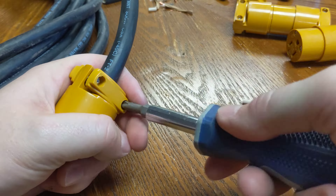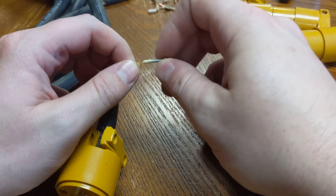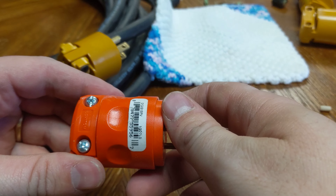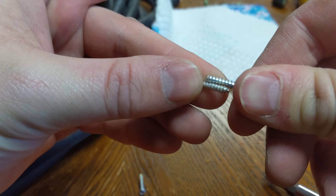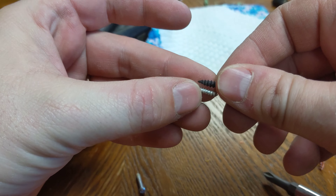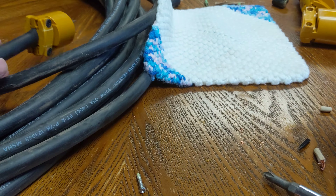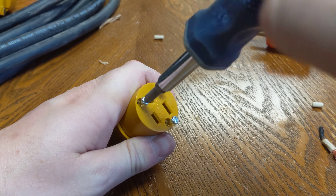I put the screws that came with it back in and they start to bite — I thought it was going to work, but this wire is very beefy and apparently the screws were just not made for that style. As I was working, I stripped one out without even turning that hard. Looking at them, the screws were made very cheaply and are very small. Comparing them against a higher-quality screw from a Leviton I had laying around, you can really see the Leviton screw is beefier in the shaft — the fins that bite into the plastic are sharper and bigger, about the size of a drywall screw. So what I ended up doing was cutting some drywall screws and using those to get good purchase and actually get the wire pinched down for a nice strong connection.